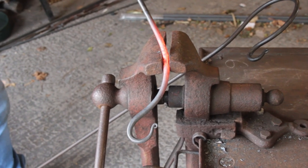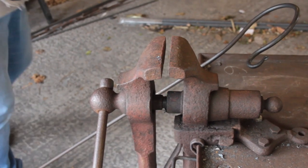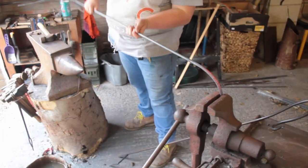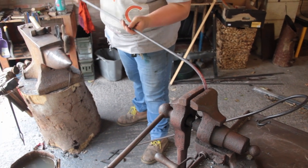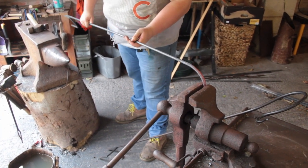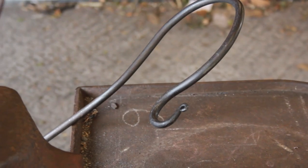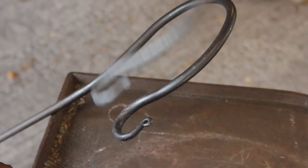I use my vice for larger bending over bending forks because a vice is much more adjustable for fine tuning. Bending is probably the most time-consuming bit of the job because it takes finesse. Because I make these so that you can buy multiples, I work to one that I've already made so that they match. If you don't have one already made, a working drawing is obviously how you do your first one.